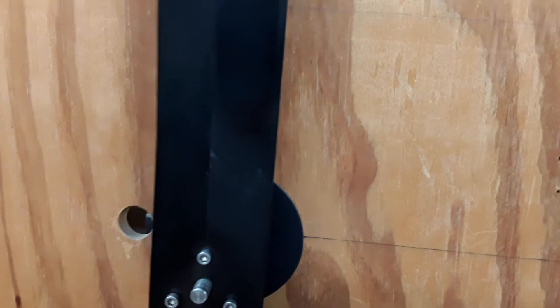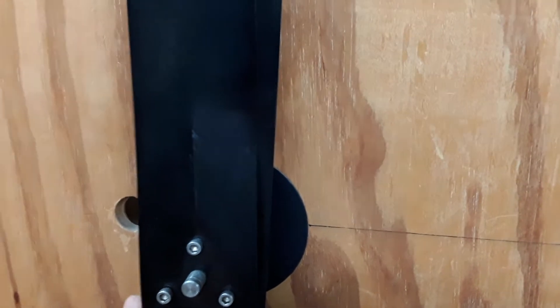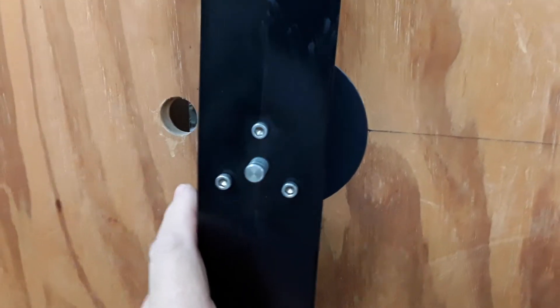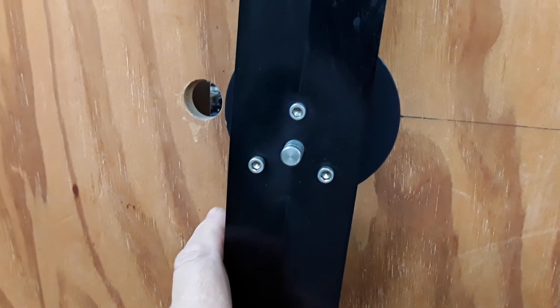This is easily resolved. You don't need to take the clock drive out to fix the second problem, which is the erosion of the minute coupler. And you don't need a lift unless the area inside the tower where the drive is located requires one. So let's take a look at that.